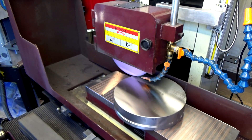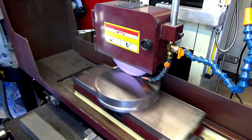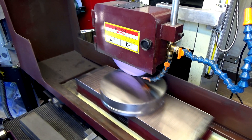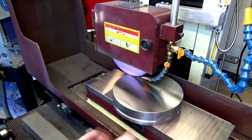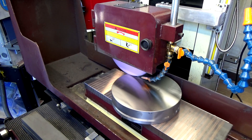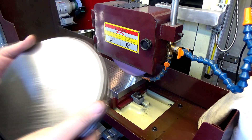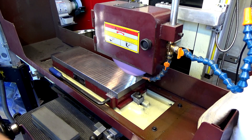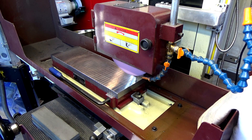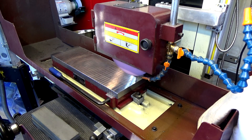There's a high spot at each end — it shouldn't stop in the middle of the part. That's because I couldn't get the wheel all the way over to those sides to compensate for the wear, or the bottom is just a little irregular. I'm going to call that good on the first one — that's just the back, the rough side. Now I should have a fairly flat reference to work off of when I flip it over to do the important side next. I've got to do two more of these on the back, then we'll do the tops.